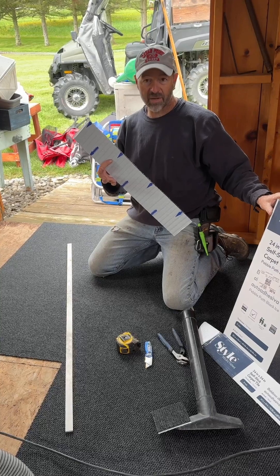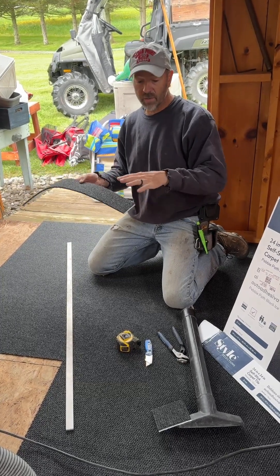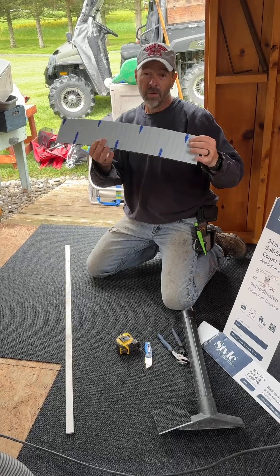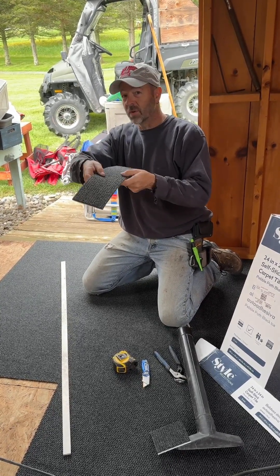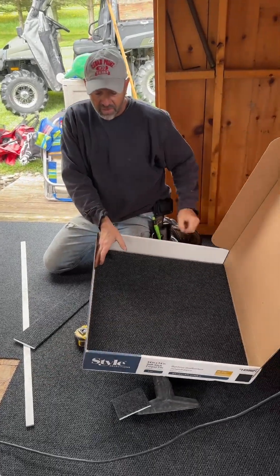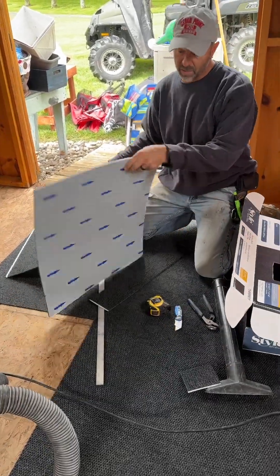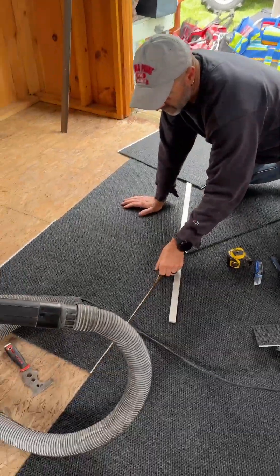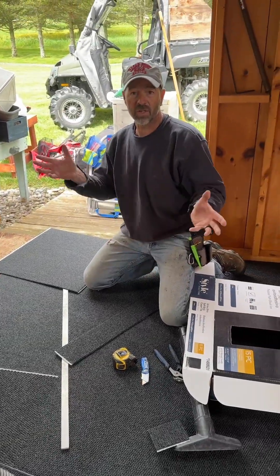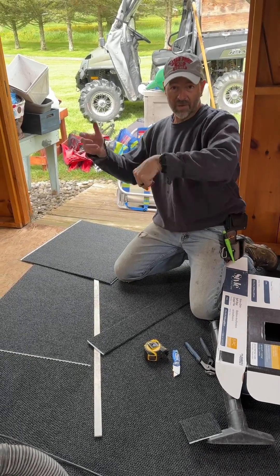The back of the tiles come with arrows to show the direction of your continued lay, so always make sure the arrows face the same direction for continuity as the tiles go down. If not, you will mismatch the pattern. You could be creative and do a checkerboard — going every other one facing one way and every other one the other way — which makes a cool pattern with alternate textures. If you want that checkerboard style, just make sure you consistently lay your arrows in the same alternating direction. Otherwise, you'll end up with a strange fuzzed-out pattern going in the opposite direction.